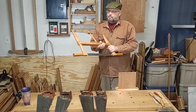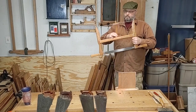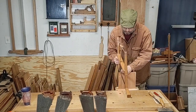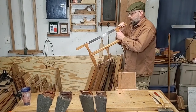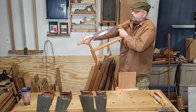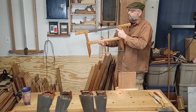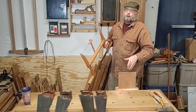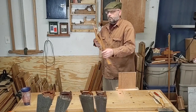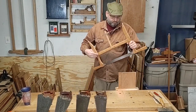Now the Danish frame saw. This is considered a frame saw, so I have to put some tension on it — one, two turns. I found with two turns on this one it does just fine. This saw is also called a continental style saw. Whenever we say a tool is continental, it means it came from mainland Europe. There's usually a difference between English tools and continental tools, though you won't find much difference today — it was just back when all this was developing.